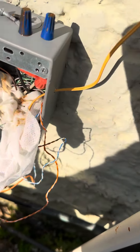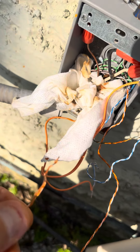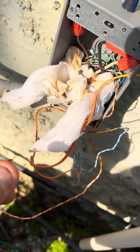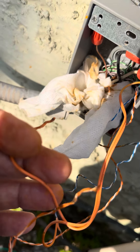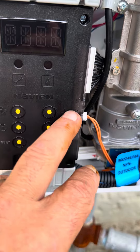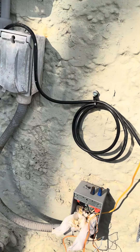When you run your wires for the controller, run 18-2, not this telephone wire with the multicolor conductors. Run 18-2. This actual wire comes from Navion — you get like 20 feet of it, it's got a male and female. I use it because you've got to be able to connect it to the PC, to the controller that's inside the unit, and then the controller that's inside the house.